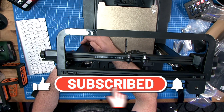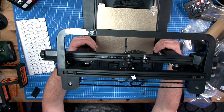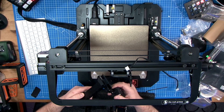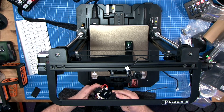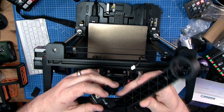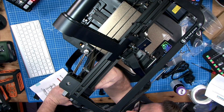If you've made it this far, please hit that subscribe button and chuck a little like if you've enjoyed the video so far. From unboxing to print is roughly around 20 minutes. As with most of these style printers, there are the usual four screws at the bottom and three screws in the side for the screen. The filament spool holder, which is also the bearing version, clips onto the top. I also took a moment to find the files online to add the Sonic Pad to the top of the printer using special brackets. The only real issue I've had is with cable management, but if you're clever with it, the cables can sit inside a cable tidy and it still looks quite elegant. The cables on the printer all plug into either motors, limit switches, or the daughter boards. The main hotend ribbon installs with a plastic connector, and it's all very well documented.